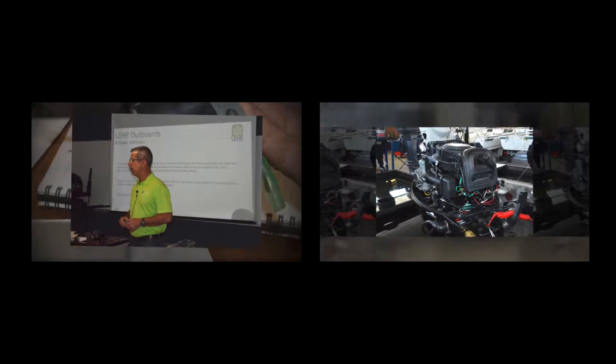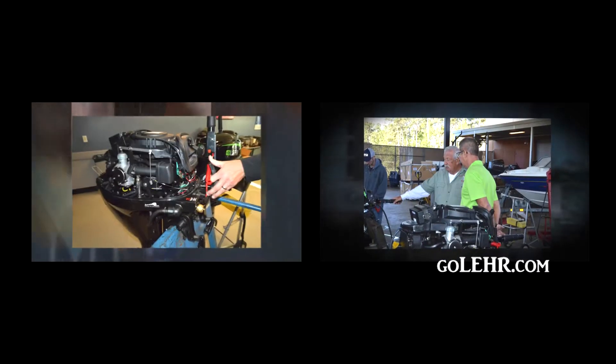The symptoms when you're troubleshooting are pretty much the same. We're going to talk about propane and how propane works. Basically all the engines run off of vapor. On the liquid draw system, the delivery system right before the carburetor, the evaporator converts it over to vapor — but all of our engines run off of fuel vapor, propane.